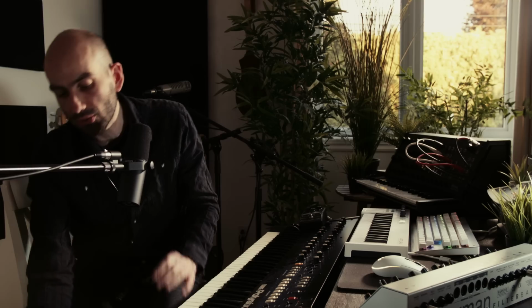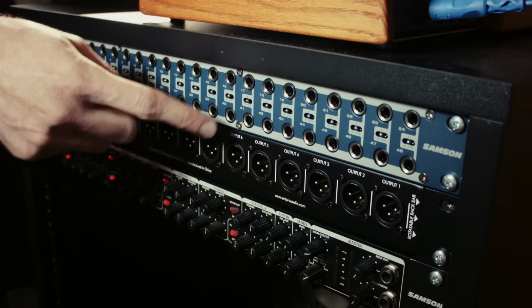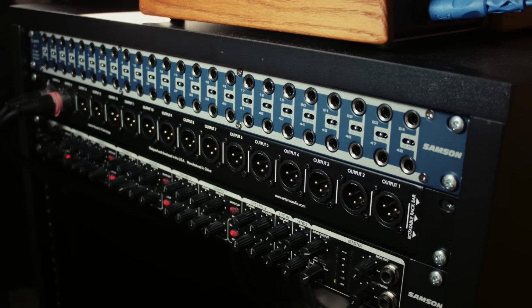The main thing I'm using this for right now is for this secondary mic here. So this mic I use as kind of my experimental mic that I run through effects. So this mic is going through this line mixer, which allows it to get phantom power as well, because I'm using a Cloudlifter. That's in this mixer here. It can get available into the 1/4 inch patch bay as a standard input. So basically it allows me to treat this mic just like I would a synthesizer in here.